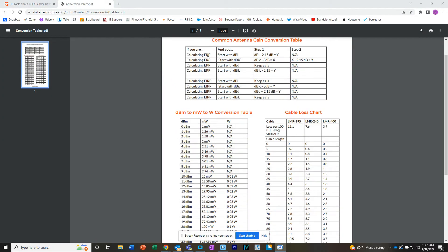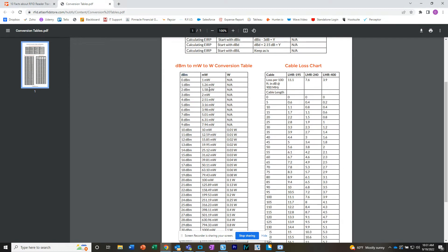Because it's a logarithmic scale, it follows a different type of system. Here's an awesome chart that breaks down the logarithmic scale of DBM. Initially it may seem completely random, but there is a pattern: decreasing or increasing by 3 DBM is either doubling the power or reducing the power by half, and that is true all the way down the logarithmic scale. Another pattern is that reducing or increasing the DBM by 10 means you're actually multiplying or dividing by 10 times the original amount.